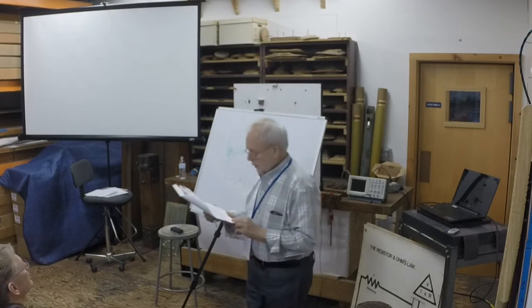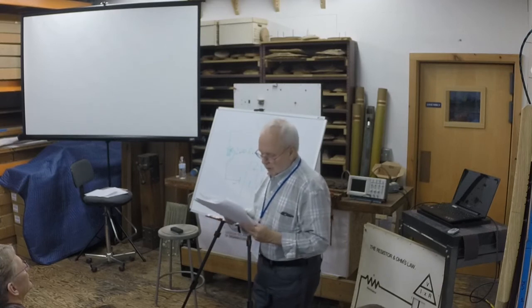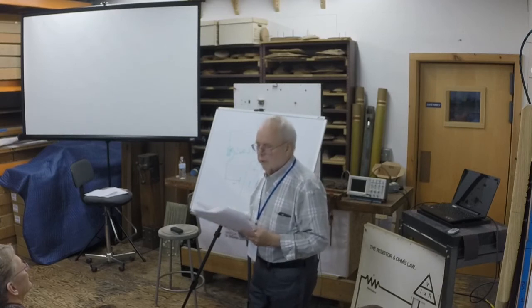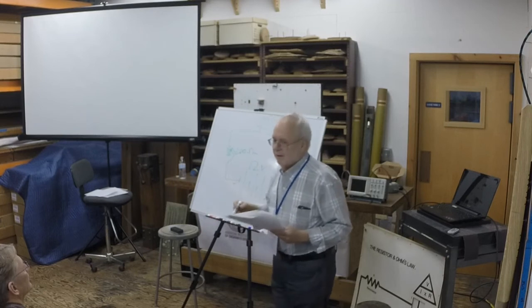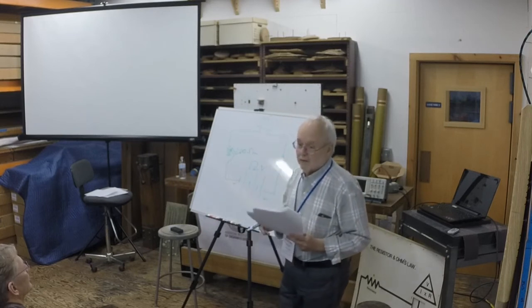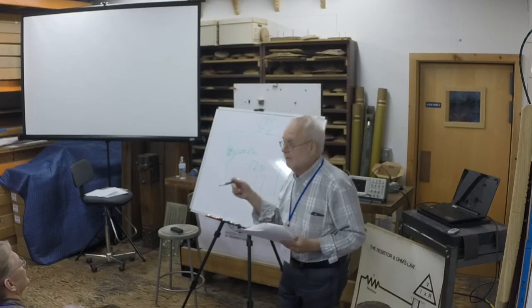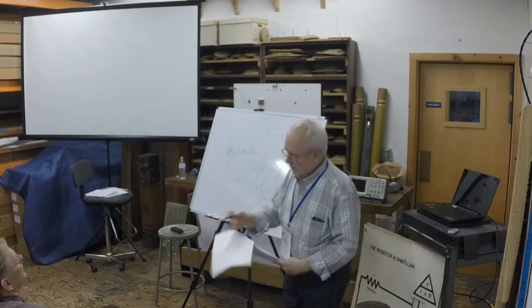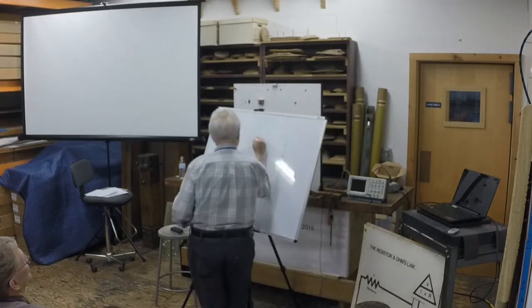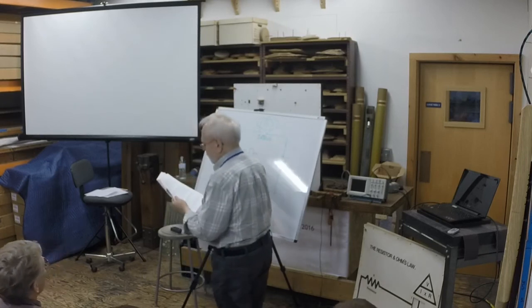Knowing Ohm's law, he works it out. What's the light bulb's resistance? By Ohm's law, he calculates that it's 200 ohms. This is all a put-up deal, and Bob should be shaking his head, saying light bulbs don't have a constant resistance. It varies with how hot they are. So you've got a 200 ohm light bulb here. 200 ohm resistor here.